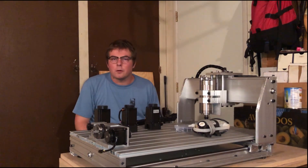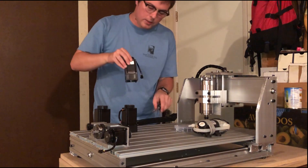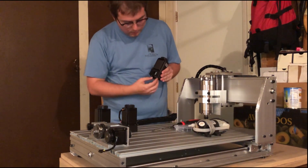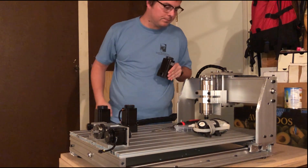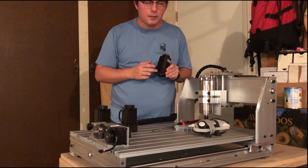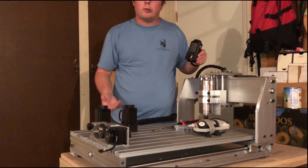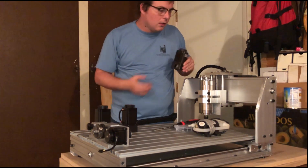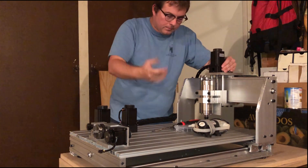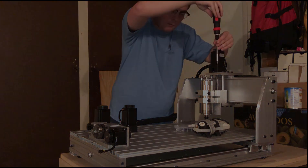Let's get started. Before installing, you'll notice that each motor comes with a standoff that provides access to the coupler so you can turn the set screw. You'll want to orient the open face of the standoff so it's facing the direction that makes for the easiest install. You'll get the hang of it, but generally the correct direction is pretty self-apparent.